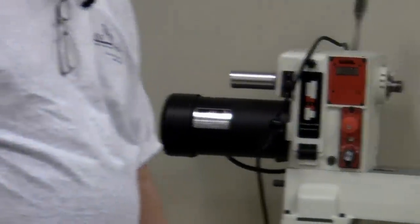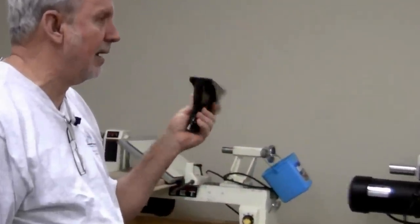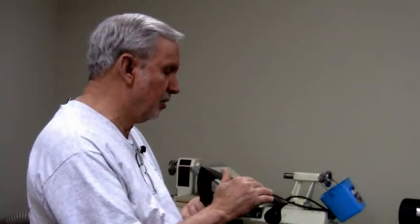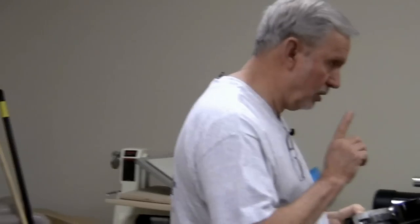I'm going to use our young new member back here as an example. He goes out and he says, ah, there's a Stanley 3C and it's only $20. I'll buy that because it's cheap. I'm full of these homilies. The remembrance of quality lives on long after price is forgotten. Better to have one good tool than five bad ones. And go on and on and on. So he brings this thing home, and now he spends the next 5 years trying to make it work right. He's got to flatten the sole. That does certain things to the mouth. The cheeks on these older planes, 99.9% of the time, are never squared to the sole. So you try that. The frogs don't meet the bed, and you go on and on about the nomenclature of this plane. If you play around with it long enough, you can get it where it will do an acceptable job. Or you can buy one good 21st century tool.